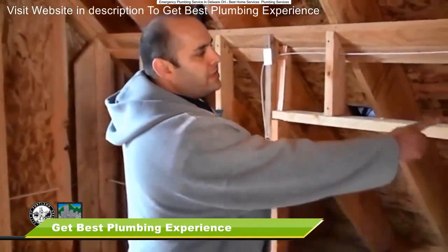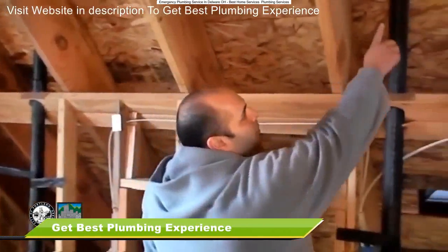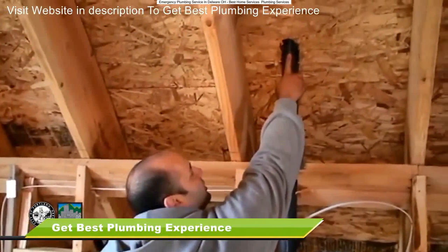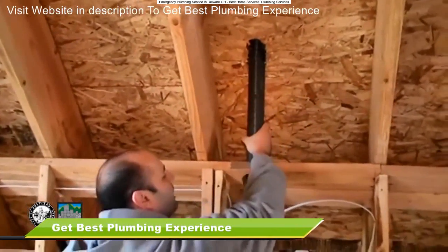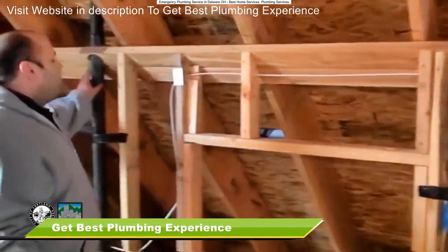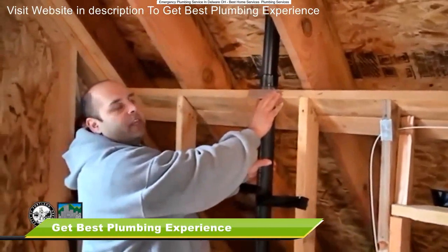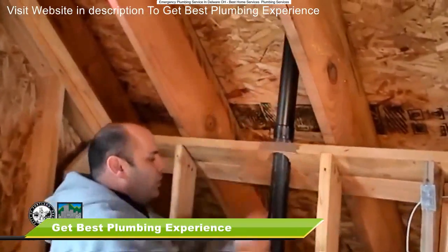Now we're looking at our vents again as they come up through the upstairs, penetrating the roof in a roof flashing to make sure the water doesn't come back down and run down the pipe. We want a good solid fit here. Same on this one. We're coming up through. We've got our nail plate protection again. Comes up through the roof.